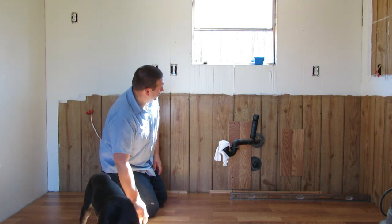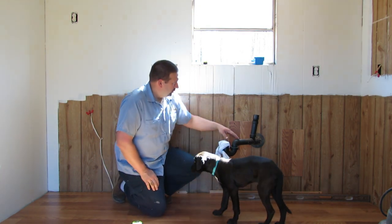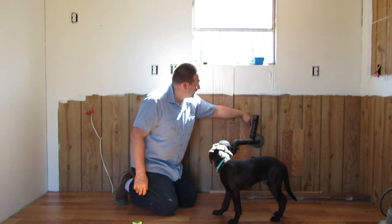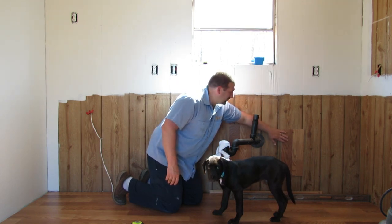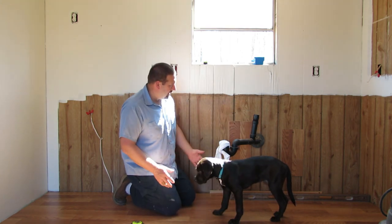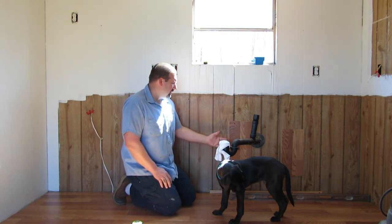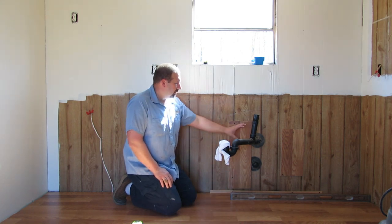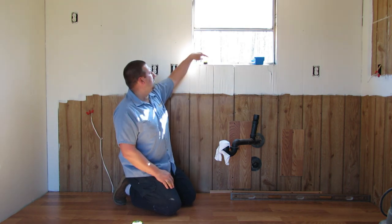I had to move the plumbing because the old plumbing was over where this block is now - the cabinet edge would have been inaccessible, behind the other cabinet. So I moved it over here and it's ready for the cabinet. Now I need to cut this off, drill a hole in the back of the cabinet, and slide it in here to get it up to 34 and a half inches.